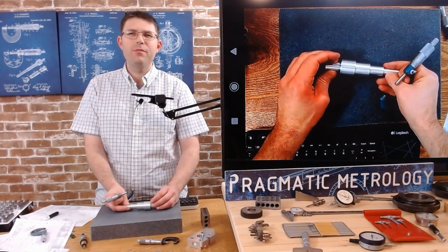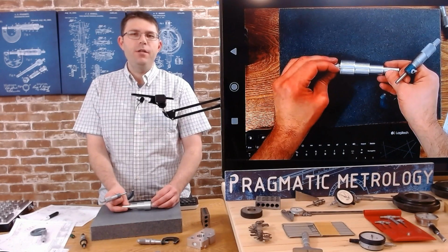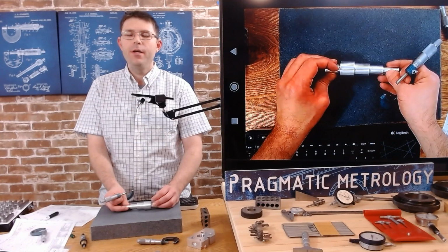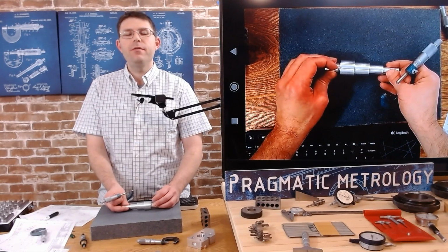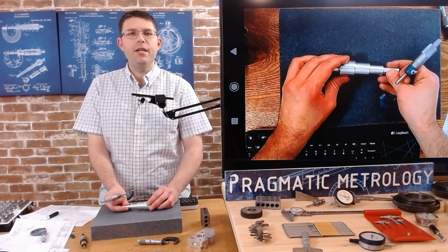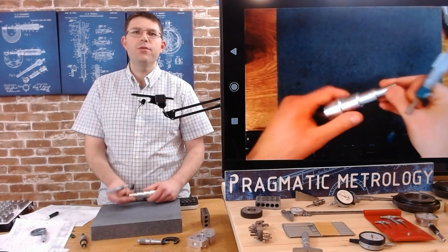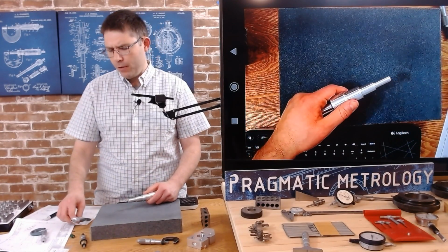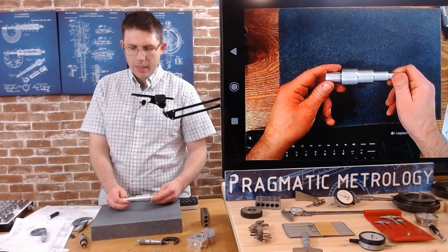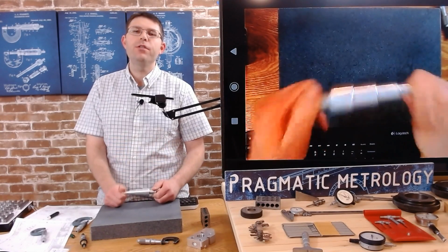A lot of people sometimes assume, well, if it came off of a lathe, it's going to be straight, it's going to be round, it's going to be concentric, there's no runout error, and you just can't assume that. And even the best lathes I've seen, there's built-in error in that mechanical system of the lathe. There's some built-in error in how we're checking it as well. So definitely want to forget that assumption and keep going. Assuming that it's not perfect and you're going to look for the error.